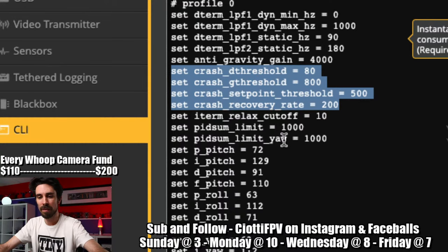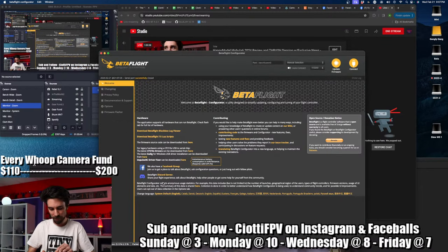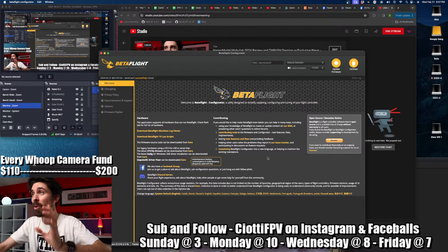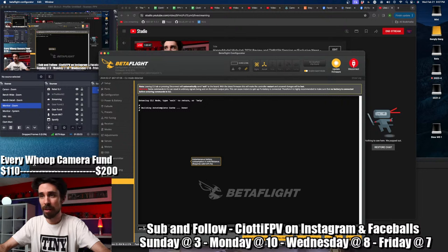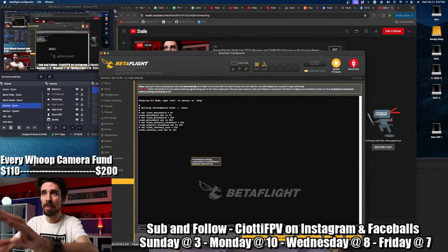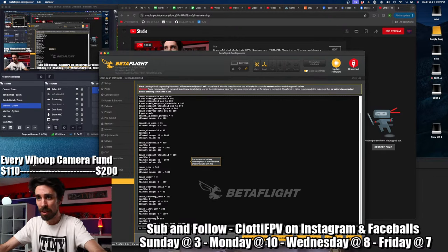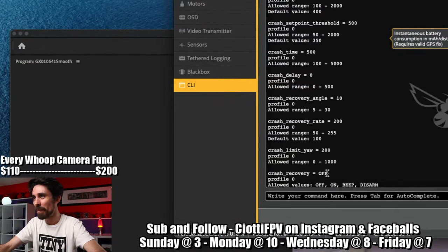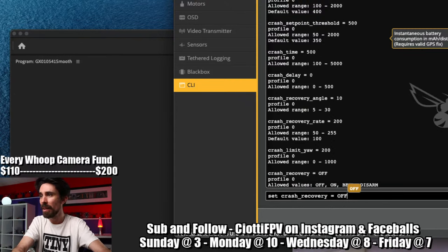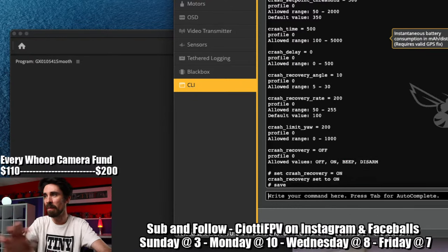I also just need to turn crash recovery on, but I can just do that with one line in the CLI. So we're almost good to go. Here we go. And all right, so that has now dumped those settings in. I'm now going to type get crash, because crash recovery is currently turned off, right? This is a problem here. So we need to turn this on. The easiest way to do that is to highlight that, copy it, type set crash recovery equals off, and we're going to change it to on. And now crash recovery is set to on. Type save, and away we go.